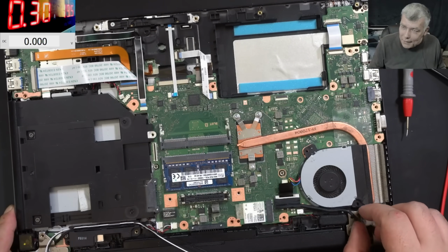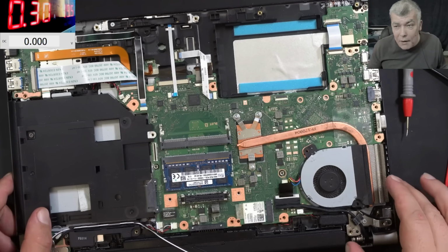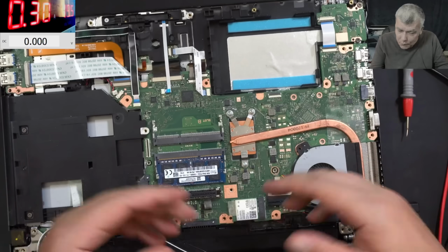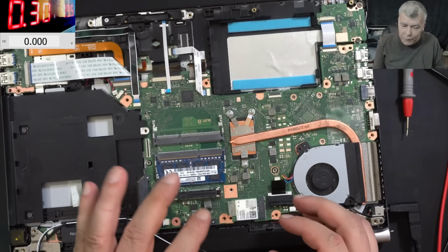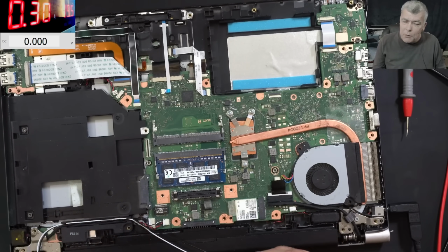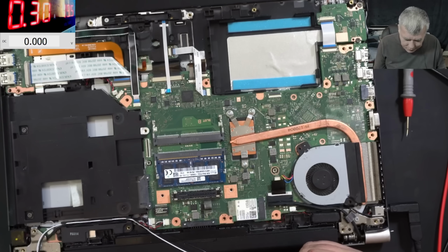On the last video, if I remember, it was the same. It was like a screen issue, and we ended up having exactly the same fault. Having multiple faults, actually. Yeah, I do believe this board is working. Actually, it's a fault with the screen. Like I said last time, you have the picture, that's fine. I can understand the CPU, bad RAM, I don't know. But we don't have backlight. Backlight has nothing to do with the picture, except in the case the board is not working, obviously there will be no backlight. But this board is working, so we should have backlight, and we don't.